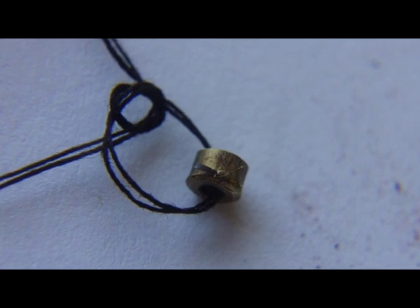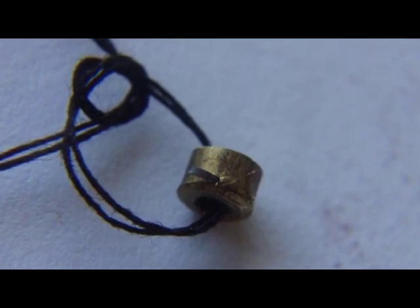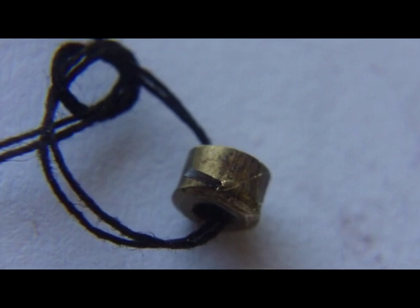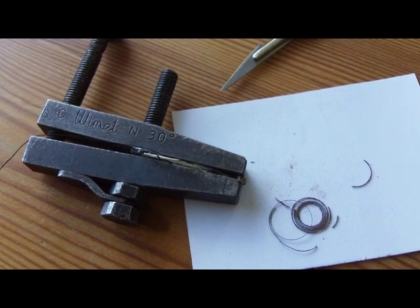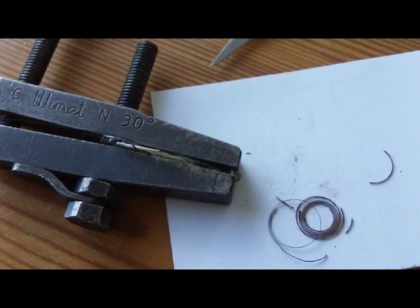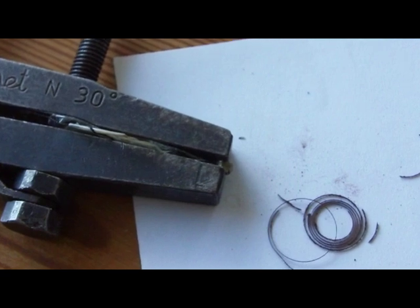Because I have a habit of throwing these small components on the floor and losing them, I decided to put a couple of bits of cotton through the collet, so if I lose it hopefully I can find it by the cotton. The cotton also stops it rolling under some piece of furniture. With the collet held with a toolmaker's clamp I managed to open up the clench that held the start of the spring and made the end free.